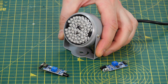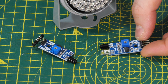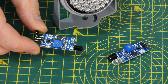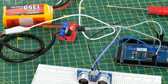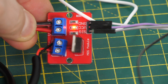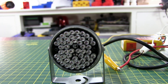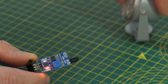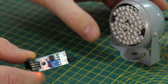To solve that, I'm using this massive infrared illuminator for CCTV with lots of infrared LEDs, and I'm going to use that as a beacon and receive the infrared with this little module. It's actually a proximity module but I've taken the LED off so it only receives and doesn't see itself. I've got a MOSFET attached to the Arduino pulsing the infrared illuminator on and off. If you use an old camcorder without a very good IR filter you can actually see the LEDs flashing, otherwise they're impossible to see with the human eye. You can see the module receiving, and if I take the infrared beacon away the light stops flashing — put it back and it works again.